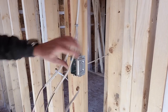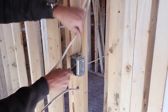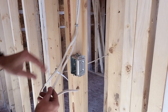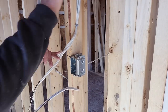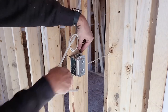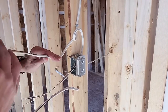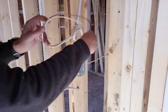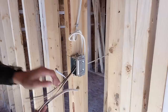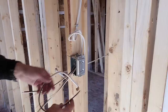Then I'm going to take these wires. You can either insert them straight in, or my preferred method is to basically coil the wire backwards — kind of just flip it over itself. I'm holding the wire towards me and just rolling it backwards. It'll make a nice loop. Same with the bottom one — pointing towards me and just loop it backwards.